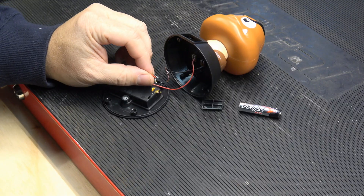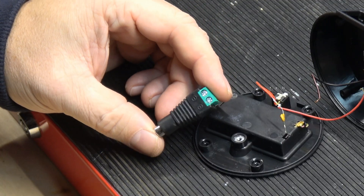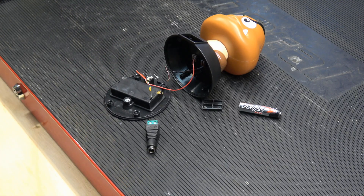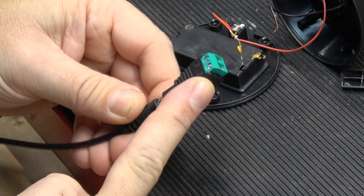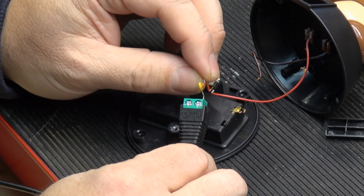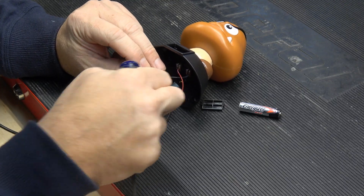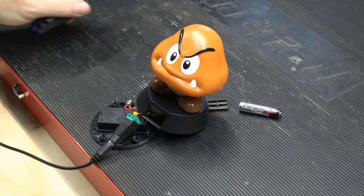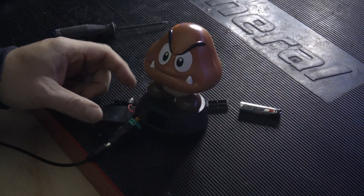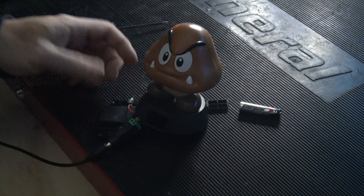Using some cutters, I cut off the capacitor from the positive side and a wire from the negative side. Now with your power supplies, a lot of times you'll get one of these adapters, which will let you plug in your extension and tap in to get wires going. I'm going to run the positive wire right into the positive port until it's nice and tight, then strip off a little bit of the negative wire and seat it in the negative port — positive and negative lined up perfectly. I did it this way so the switch would still work. If I just hardwired it in, as soon as you plugged it into the power port it would be on. But this way I can still use the switch, which retains its functionality.